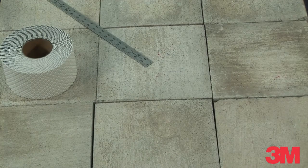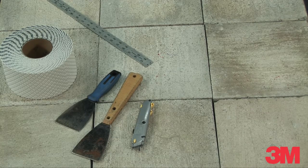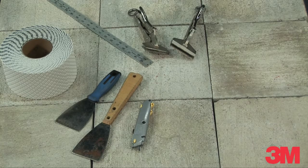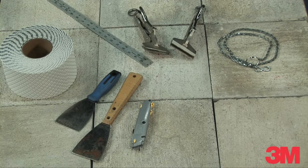To conduct this test, you'll need a knife capable of cutting through pavement marking tape, a wide bladed scraping tool to help remove the tape from the road surface, a tape gripping clamping device to securely hold the tape for peeling, a strong flexible chain, thin wire rope, cable or cord approximately 3 feet long, and a handheld digital tension gauge accurate to at least 50 pounds.